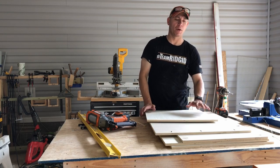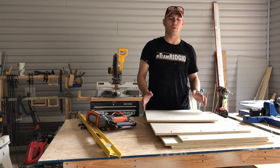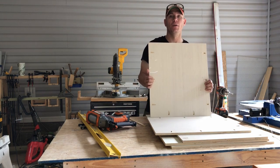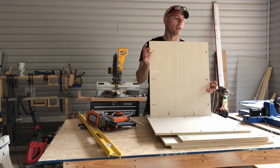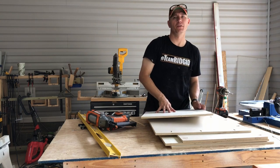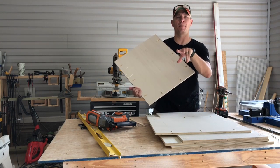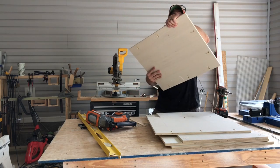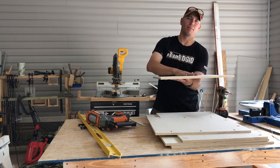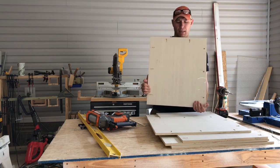What I'm going to do now is assemble everything. I wanted to get two shelves cut out because there's no front on this cabinet — it's going to be a door there — so I wanted something to give me stability. With shelves inset on the bottom, top, and middle, that's going to give us plenty of stability to work with. On the middle shelf, I'm going to attach the edge banding and then cut a hole so the cat can jump through and get down to the bottom. I've got pocket holes — two that go into the back of the box, three on each side. That should be plenty to hold it. You're not holding more than 20 to 25 pounds for a big cat, so there should be plenty to hold that up.